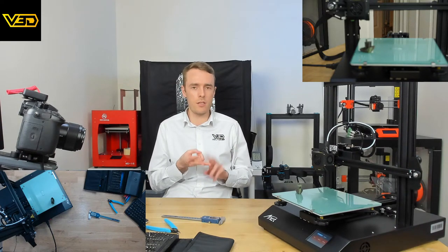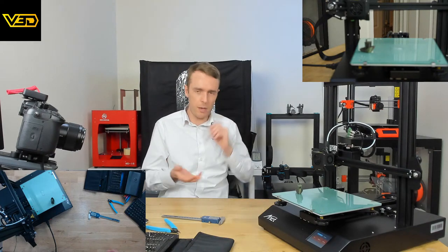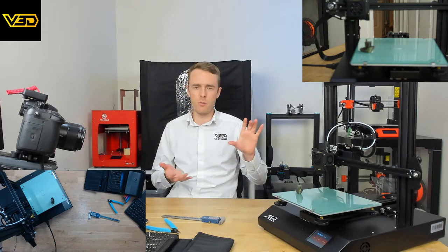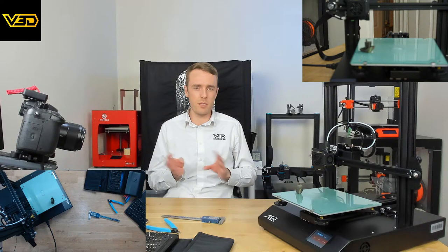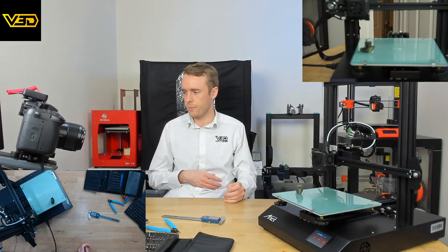Both of the mains wires, the live and the neutral, were cut with a switch, so that's also good. The power supply used is a genuine Meanwell unit, 320 watts, which should be sufficient for this sort of setup. Although it is that 320-24 type power supply has potentially bad electrical interference and not great on European circuits.